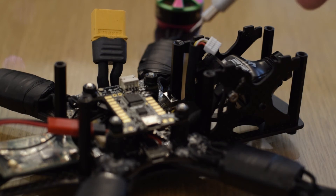What I did was a bit different with the switch — I wouldn't advise the switch, there's no benefit from it. I did it because I thought it would give me the ability to change between mic output and smart audio output for clean sound. But in all honesty the switch is kind of irrelevant, because the only noise you pick up from the smart audio on the mic happens when you're arming or changing channel. You're not doing that while you're flying, so it's not going to be distracting. It may happen a few seconds after you arm — that's it. It's not going to change the way you fly or ruin your audio feed.